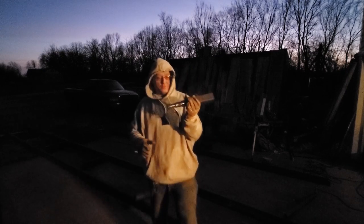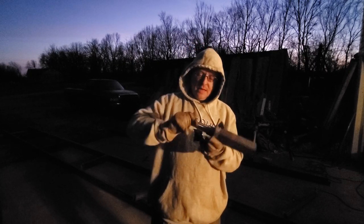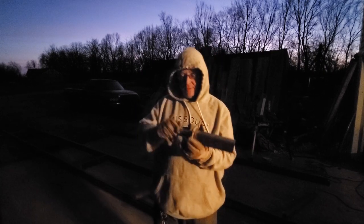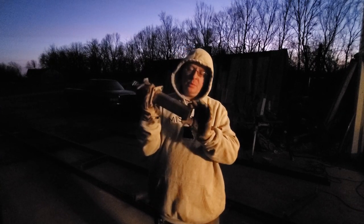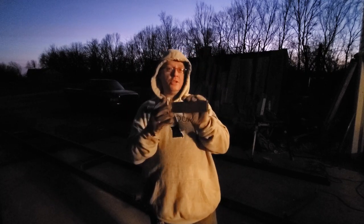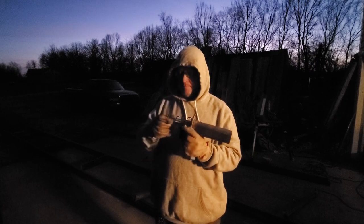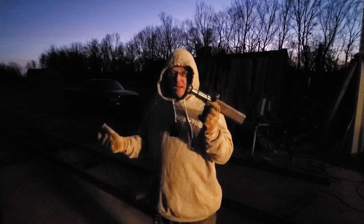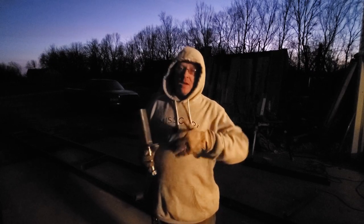So anyways, a lot of work went into just getting everything perfect on this thing. And I'm really hoping I didn't screw it up, honestly. So we've got these solid axles right here. Well, that's interesting, that feels kind of galled. Yeah, that's better. I'll have to make sure there's no BBs or anything on this from welding it, but I'm pretty sure there's not. Anyways, this is an axle stub end right here. Basically, I welded this piece of tubing on here, so it will insert into a receiver hitch tubing that will be welded to the bottom of the sawmill trailer to make it mobile. So we can take the wheels off. That's just an added security thing. It also gets your tires out of the way, so you're not having to work around them if you're doing really long stuff, but primarily it's just a security deal.